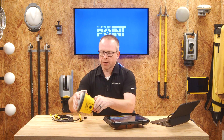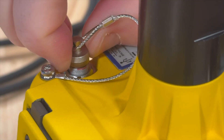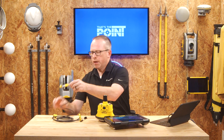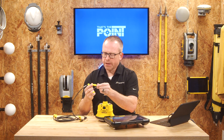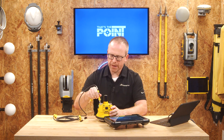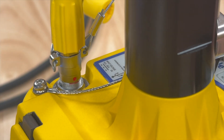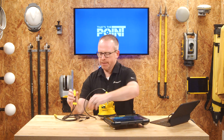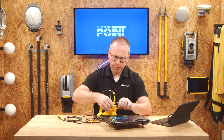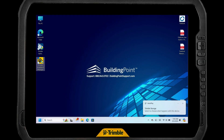The first thing we're going to do is take our receiver and power it on. Let that start booting up. We're going to take the LEMO connector — that's the smaller silver connector on the bottom — and connect the USB cable to that. When lining this up, make sure you don't manhandle it and bend any pins. We like to line up the red dot on the cable to the red dot on the base of the receiver, then snap it right in. Then we connect the other end into the USB-C to A adapter, which we plug into the tablet. Once that happens, the tablet recognizes it — it may show a storage notification or make a sound — and we know it is connected.